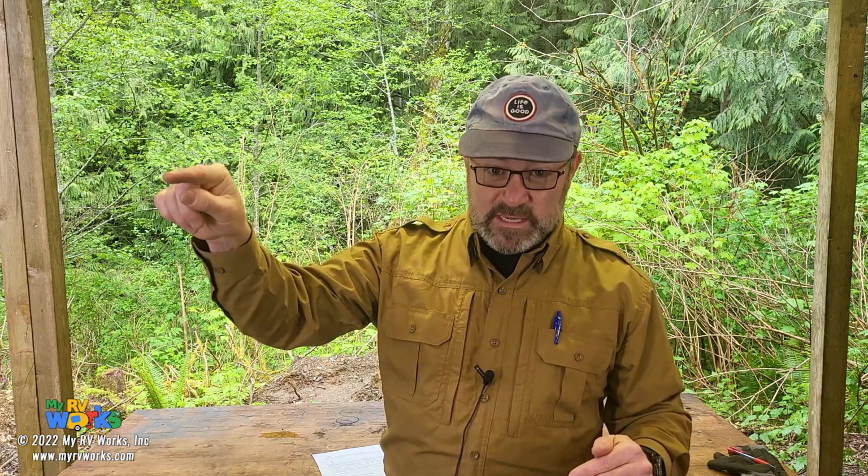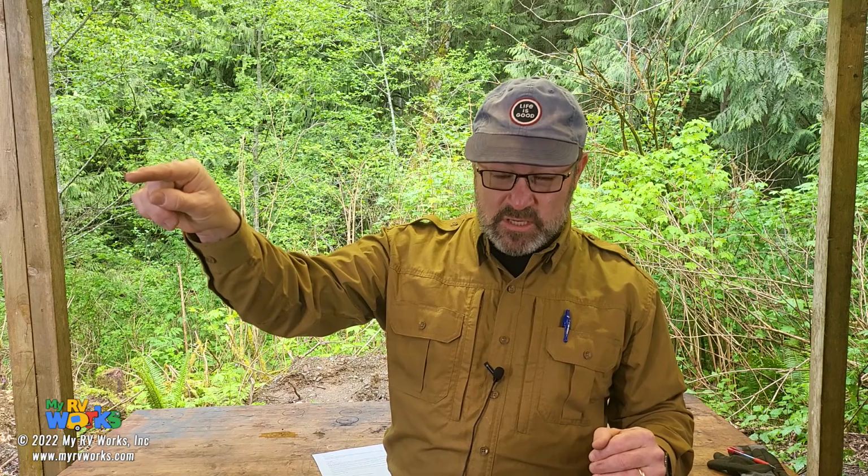But that's something you can try. I wanted to offer that. But check your fuse first. If your water heater's not working, my point is that electricity enters that circuit from the switch. So we need to make sure that there's power at the switch, okay? And if there is, then we can carry on along.